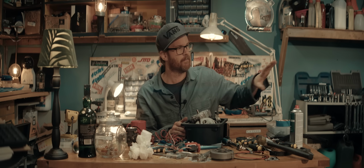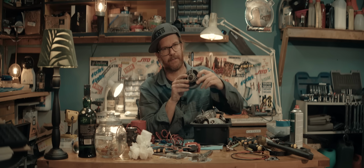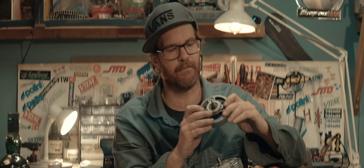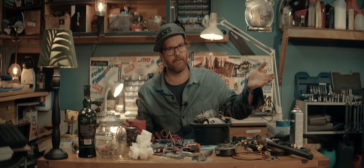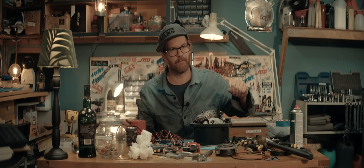While the coolant is heating up, I want to explain some stuff. The reason I'm reluctant to put something like a centrifugal clutch on the supercharger drive, to make the engine spin up without any drag from the supercharger and then have it engage at higher RPM, is that mounted in the actual bike with a variator, there won't be any load except for the supercharger on the engine at low RPM. And I know without any additional load from parts of the dyno, it revs up.